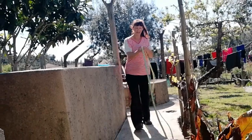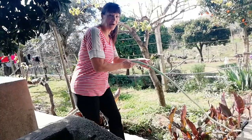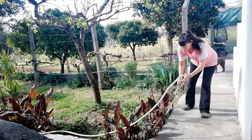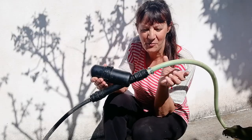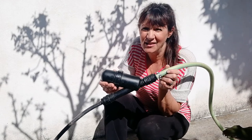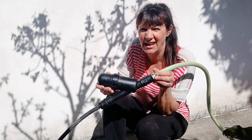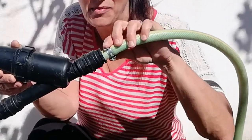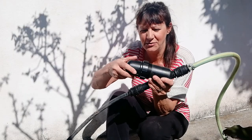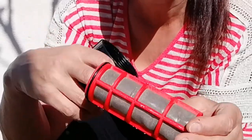From the water well we follow the pipe all the way to this filter. The pipe from the well comes onto this filter. Now our water — you can't drink it but you can use it for washing, cleaning, everything else, and irrigation. The pipe fits onto this filter by a jubilee clip. Let me show you — we've been watering for a few days, let's see how filthy this filter has become. There are little tiny particles, so you must use a filter on your irrigation pipe. So: water well pipe, to the filter, to the 15mm irrigation.